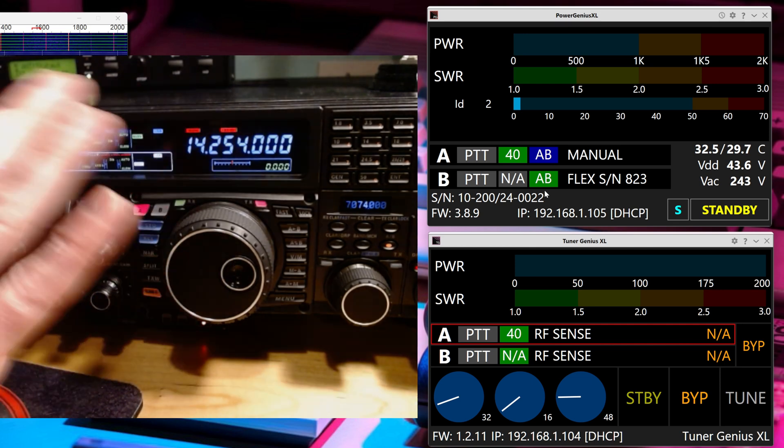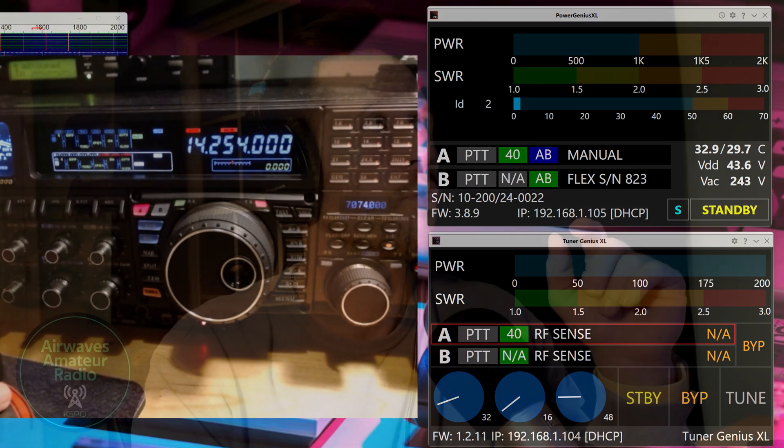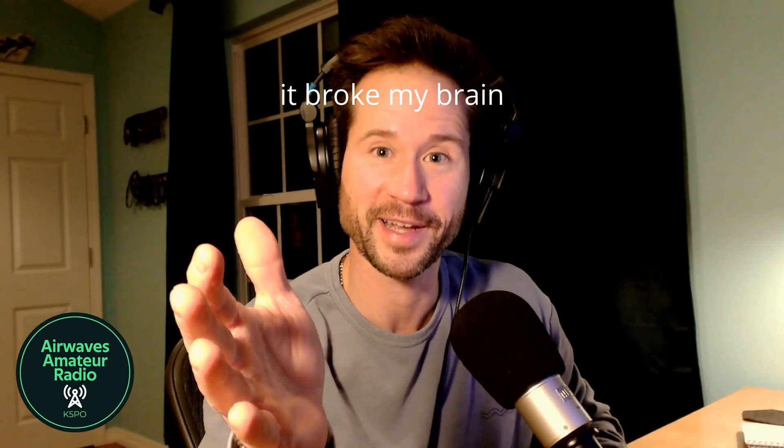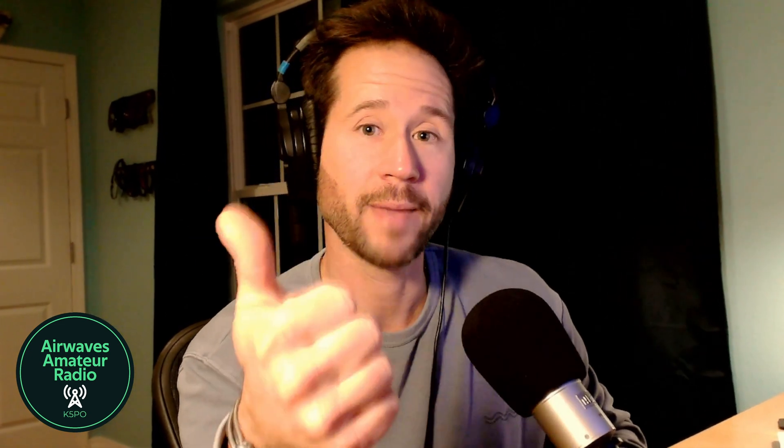Obviously they're not connected anyway and I haven't transmitted yet. You have two primary options for communicating between the rig and the amplifier and the tuner without having them connected via CAT, CIV, band data, or whatever — which is manual or RF sense. RF sense is the closest to automated in that you don't necessarily even need to tell it anything different is happening. Manual — you're a bit more in control, effectively pressing a button to let it keep going.